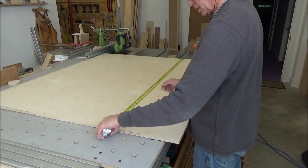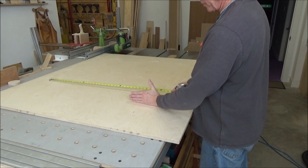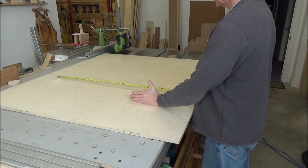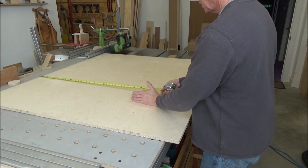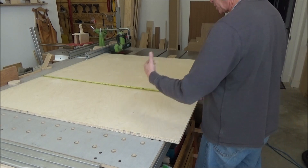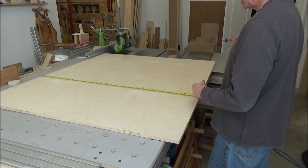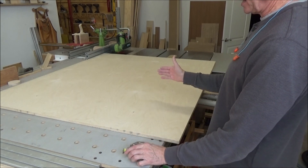The sheet is four feet long — actually this measures five feet — so I could rip off a foot here, but I'm not going to do that. I'm going to use that to square things up. What I'm going to do is cut this into two manageable pieces, 31 and 21 inches, and then I can more easily rip my 10-inch pieces off.